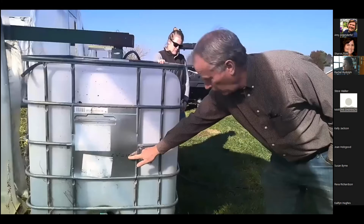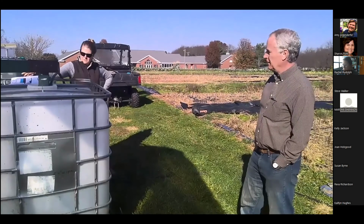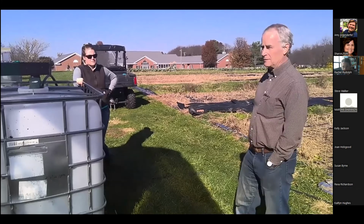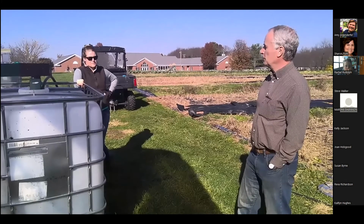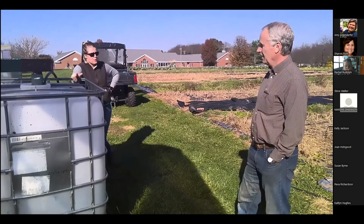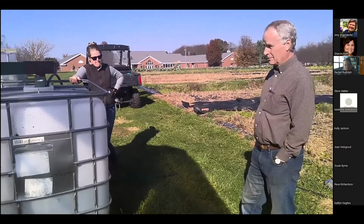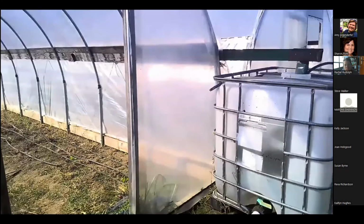So we found in hundreds of tests here at UK, and also in Southeast Asia, that we could irrigate even up to a quarter of an acre with about 5 feet of water pressure. Sometimes even down as low as 3 and 4 feet. And your standard tunnel, let's say a 30 by 96 tunnel, is 0.06 of an acre. So we're well within range to be able to irrigate with something like this at the height that you need. And this tunnel is only, I don't know what, 12 by 60 or something. Yeah, maybe 15 by 40 or something like that. But they've been irrigating with this tank for several years now.